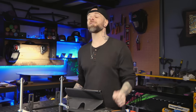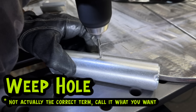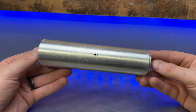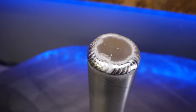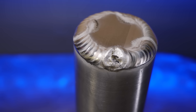I'm going to introduce you to our friend that's going to save the day: we are going to drill what I call a weep hole. I'll drill a hole right in the center of the pipe length — and the location of this weep hole is important, which I'll explain in a second. What this does is allow our expanding air and gas to vent through this area so it doesn't mess with our welding. The conditions of our weld will remain the same from beginning to end — no sudden interruptions — and we finish with a nice little button, a much better result than that crazy mess.